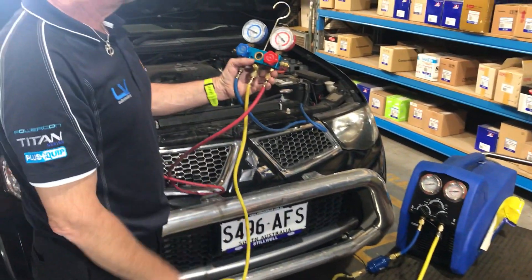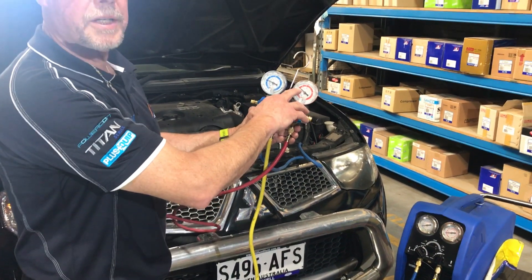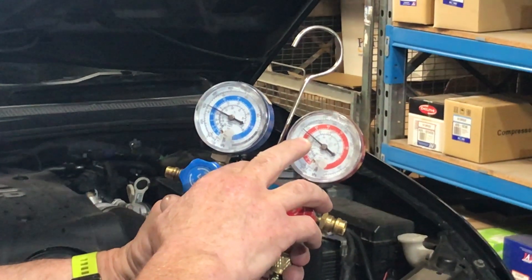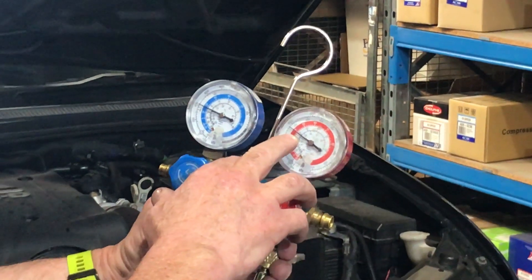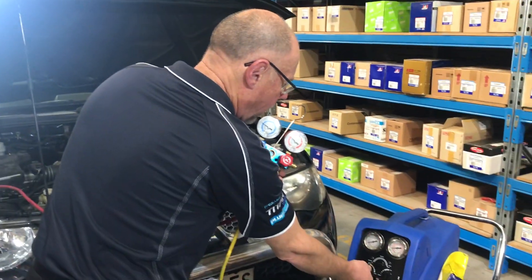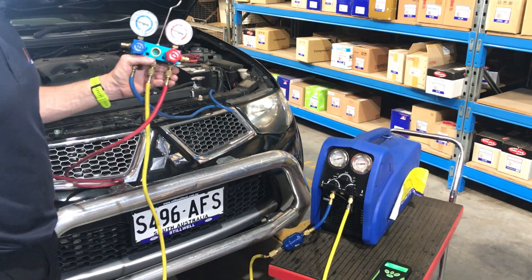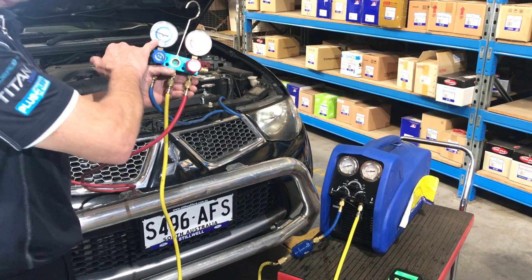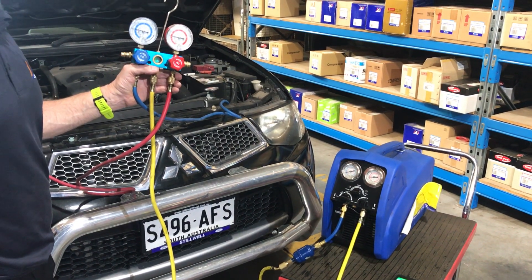Watch our pressures here. You can see, if you come in on the high side here, you'll see it gradually dropping. We're down from initial start at about 175 psi — we're now down to about 125. I'm pretty confident that I can open that up now and we shouldn't have any liquid. So we can open that all the way up and we'll just go on recovering until the low side gauge drops to zero, and this one pulls down to zero or tries to pull into a vacuum. We'll come back in a sec.